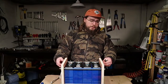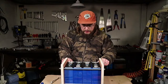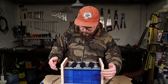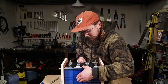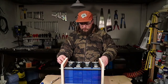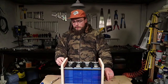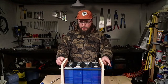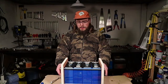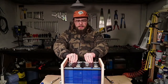In order to stop all of the components inside the cells from delaminating and coming apart, we just put some clamps on them. This is a very simple clamp system — just some threaded bar with plywood on either side. We're not going to tighten them that tight because the cells won't have expanded at all at this low state of charge. As they charge up, they will expand slightly — probably just a few millimeters if the cells are in good condition.